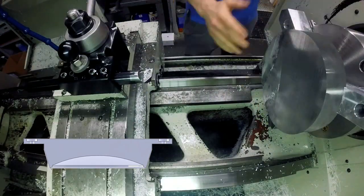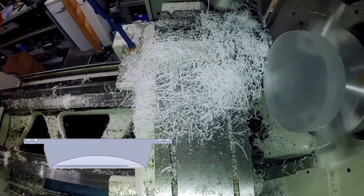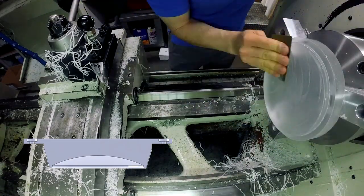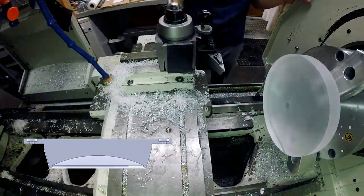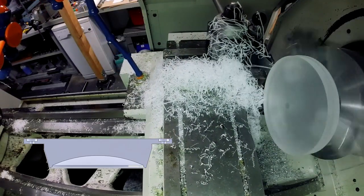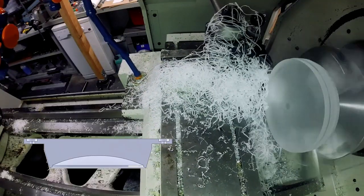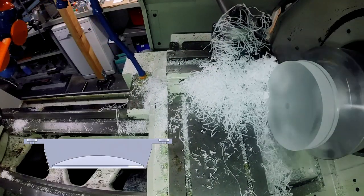So I abandoned the torch and just went to using a microfiber pad with some polishing compound to polish the parts to a clear finish. I used different levels of sandpaper, probably starting with either 400 or 600 grit, then going to 1000 and then 2000 grit sandpaper to polish out the sanding marks and machining marks. Then I went in with the polishing compound and microfiber pad to finish the polishing and get that clear finish.